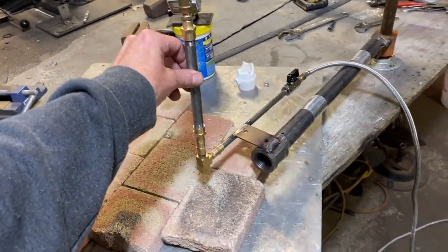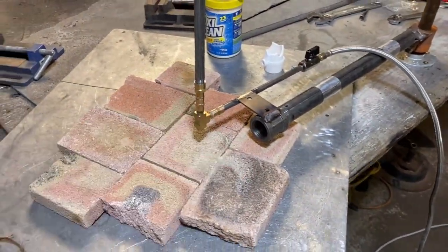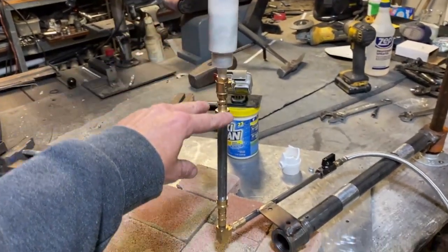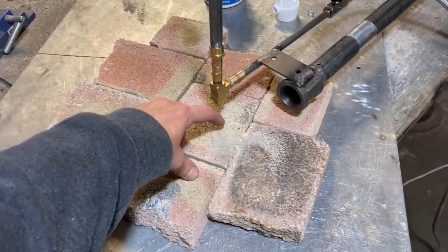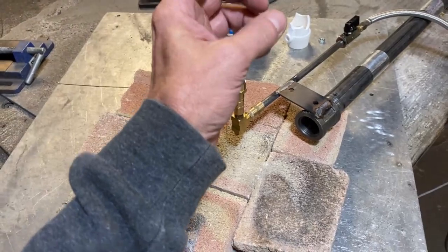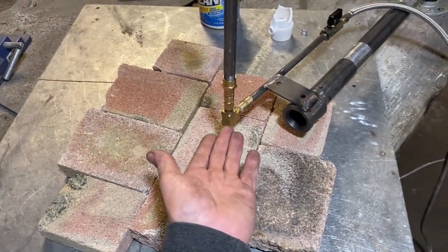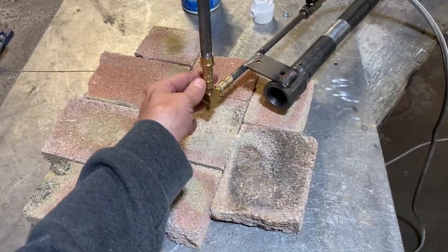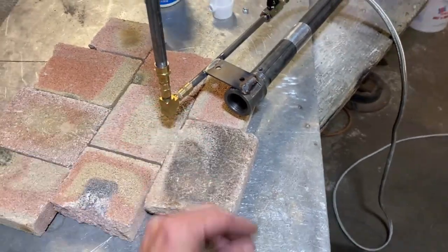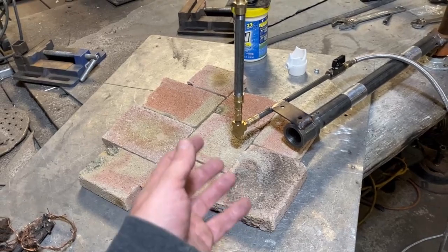I have this torch on a swivel and I'm gonna run across this material and try and build a wall of sand. I'm not trying to melt the sand as it's passing through the flame - I'm trying to melt the puddle of molten material, at which point the sand particles will impact into that and stick. It will cause the buildup process to be a little bit better. Then as the torch scans, it will melt previously clogged clumps of unmolten silica. That's the way I want to do this.